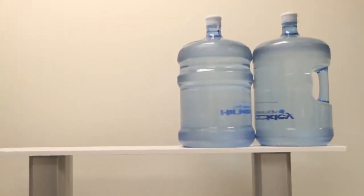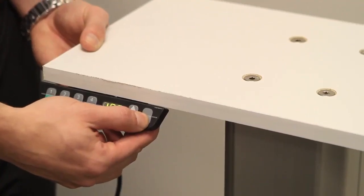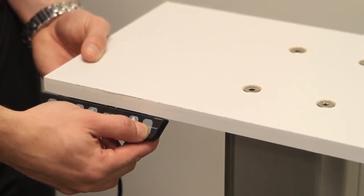extend very high. Inside the actuator are what we call internal limit switches. These limit switches are wired in series through the motor. So when the actuator hits the end of stroke, it'll automatically turn itself off. It won't let you go any farther, and it won't cause any damage to the motor or the outside of the unit or anything like that. So the Thomson Advantage is the extension to retraction ratio, the moment load capability, and then the ideal combination of noise and speed.